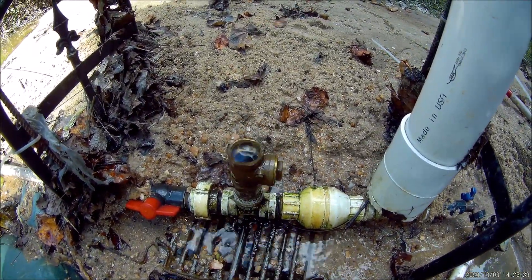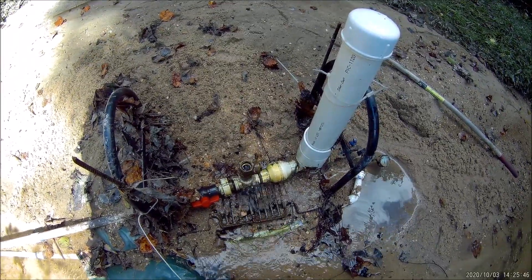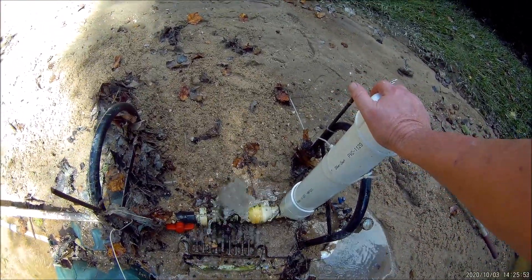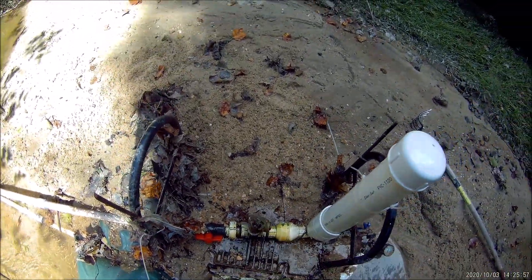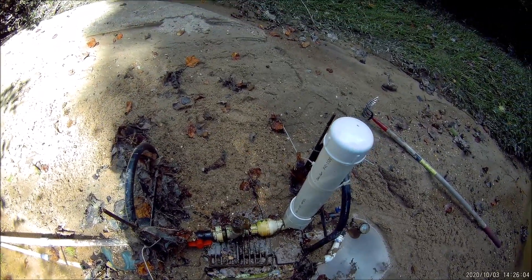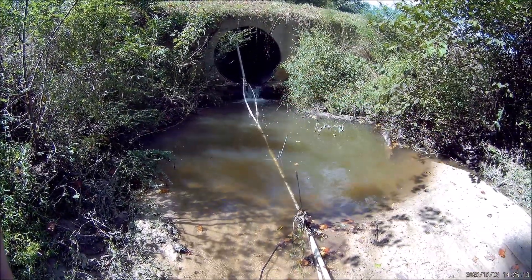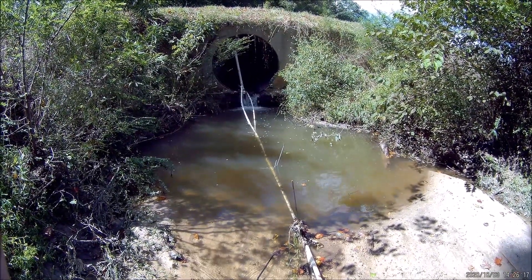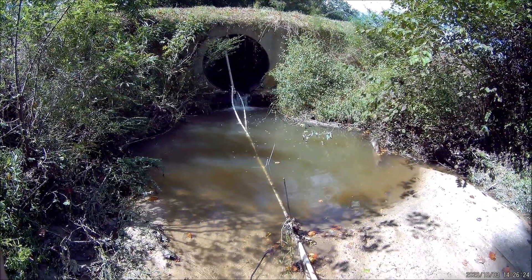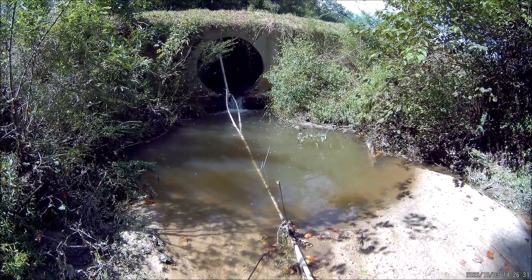Check valve's working okay, but I don't think I have as much pressure as I normally do. Maybe I need to clean my pressure tank out or something — I don't know what's happening here. If I had my wrench I'd take this thing off and make sure it's clean in there. I've got a drain valve, a clean-out valve, just below my standpipe — it's two inches in diameter. Usually when I open that, the water's gushing out just like a fire hydrant, and today it's only about half the pressure. I did clean out the intake.